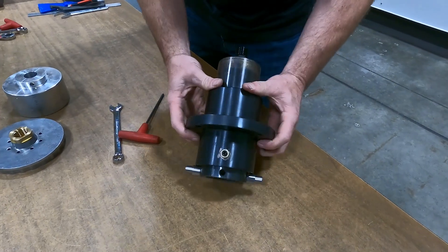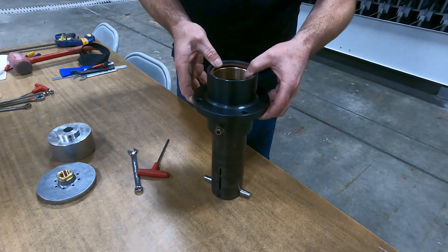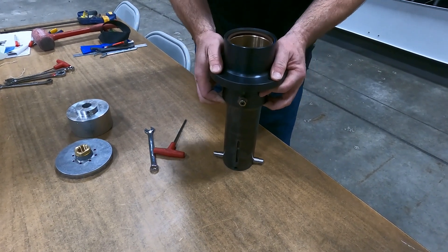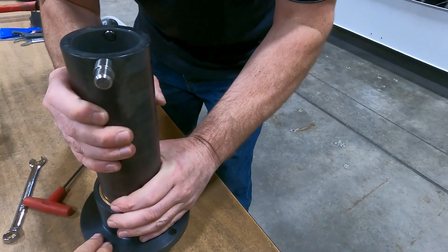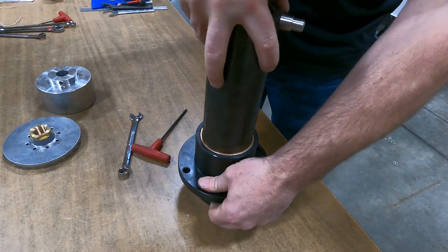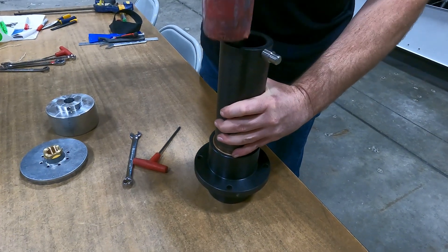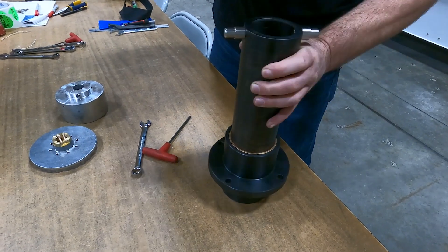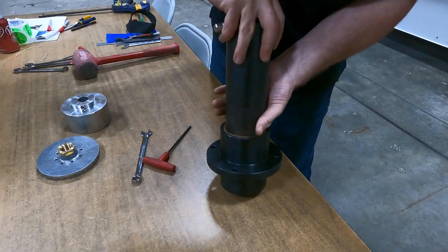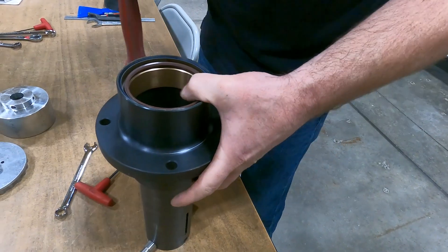You don't need to come all the way out — we'll see how far we need to. That popped up, so we can slide that all the way off. Yours might be coming off a little harder since this is a new spindle — if yours was bound up. These are a snug fit, so you need to make sure you're coming off nice and straight. Just give it a little tap to straighten it out and make sure you come up nice and straight.